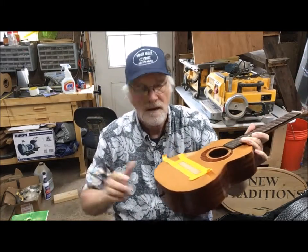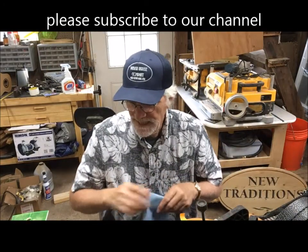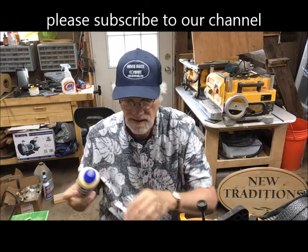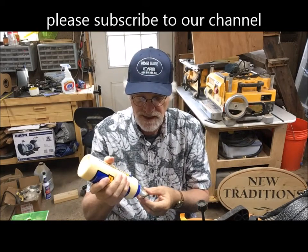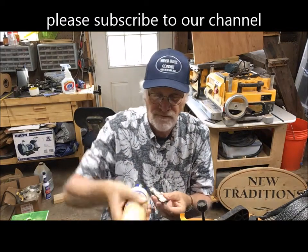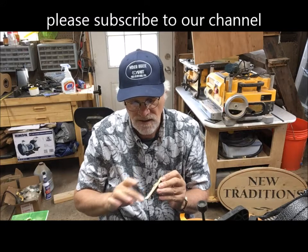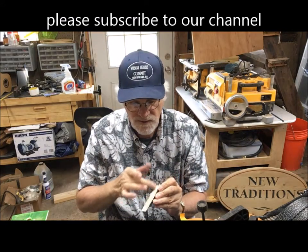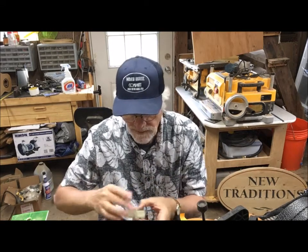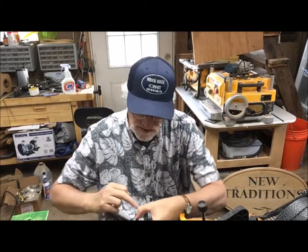All right, so I'm ready to get my clamps set and ready to glue my bridge back on. All right, so my clamps are in place. I'm going to go ahead and open my fresh bottle of glue and begin the gluing procedure. A couple of things to have on hand here is some water and rags, because you're going to want to, with a wet rag, wipe away any glue that oozes out. And if there isn't any glue that oozes out, then you don't have enough glue. You want to see glue squeeze.